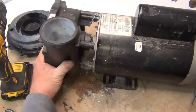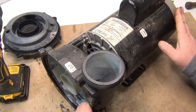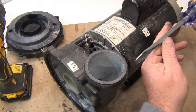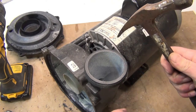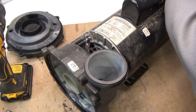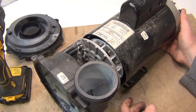What we're going to do is take the four screws off — there are two here and two on the bottom. Once you've got the screws undone, don't pull them all the way out, just leave them there loosened a little bit. Then take the screwdriver where you tried to hold it and get it in there, and bang the end of it to move this forward — the body will move away from here. Once you've got that popped out slightly, bring it out carefully.